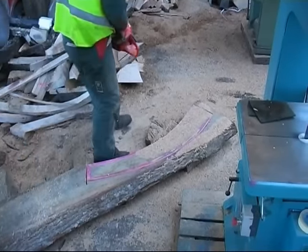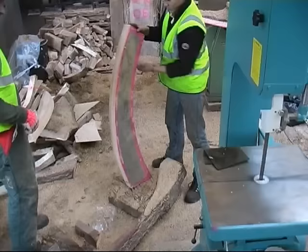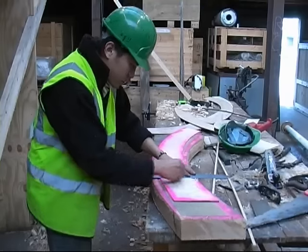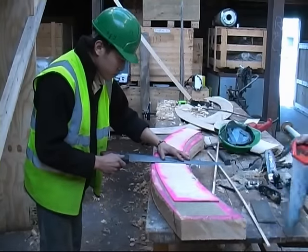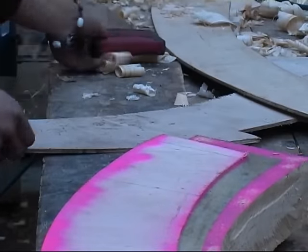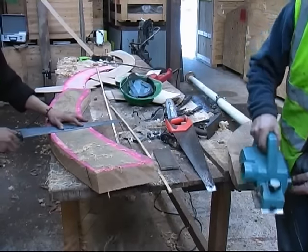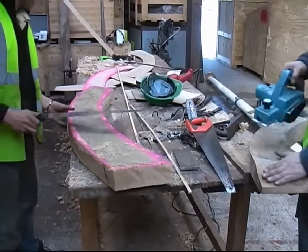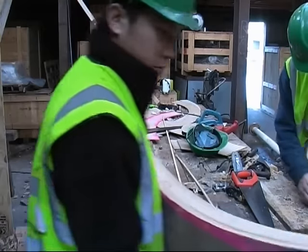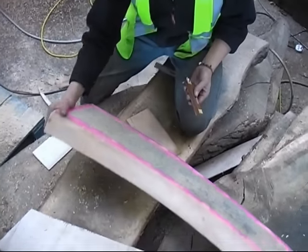It is important that this is cut out larger than required to allow for the beveled angled edges necessary to ensure a correct fit. This futtock is on the center frame of the boat, so it is fairly square. But the slightest angles are nevertheless recorded to ensure that the framework fits exactly within the existing hull shape. Ak marks out the positions where the angle readings were recorded.